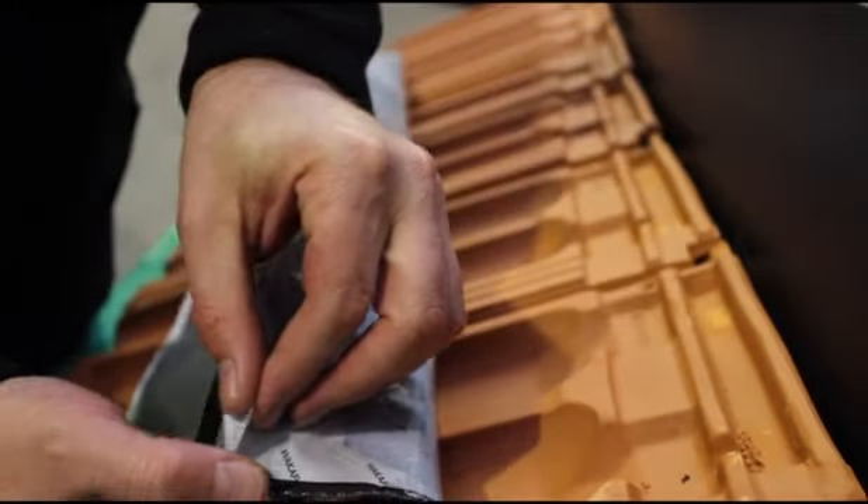When you're ready to install, only remove the top and middle sections of the protective backing separated by the perforations. Remember, the top section of any flashing always needs to be built in, chased in or overflashed.